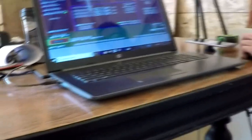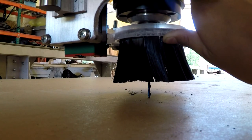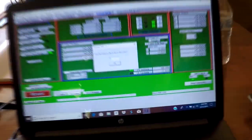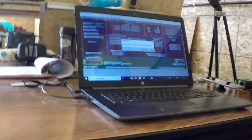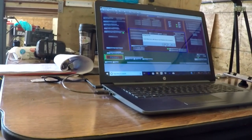Let's do the Z axis to make sure it is calibrated correctly. I'm going to the Z axis, press OK, and have it go two inches into the positive region. We are at two inches — so 1600 steps is correct. That's because it's a lead screw that is two turns per inch, set at 200 steps per revolution, and set at quarter-step microstepping. So that would be 800 steps per revolution times two turns per inch equals 1600 steps per inch. That makes sense.